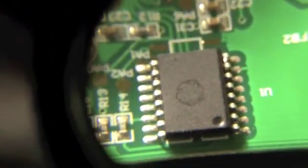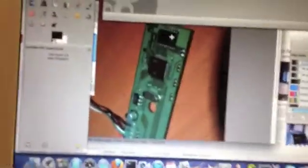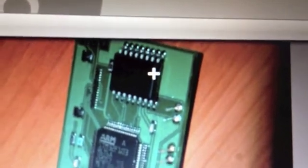The very interesting thing is this little companion chip. Every piece of information has been stripped from it. Looking at another board — a Datel board that also works on PS3 and Xbox 360 — it's basically composed of a main ARM processor and a companion chip. I'm pretty sure it's exactly the same companion chip as on the board I have. On the Datel board it is actually labeled: it says RAW, developed by RAW Science, with serial number XB101.